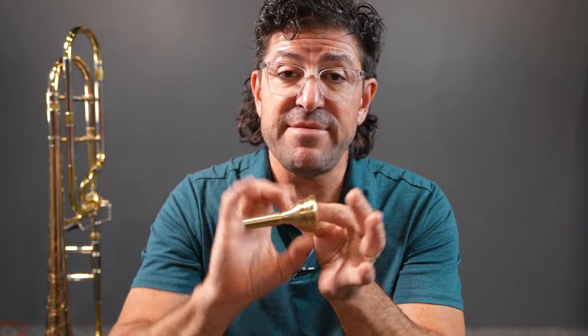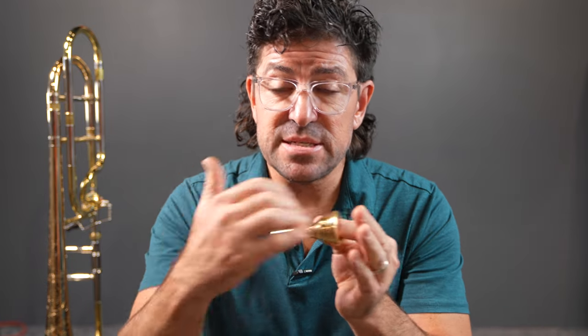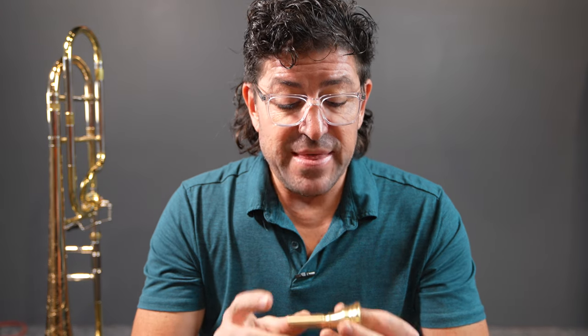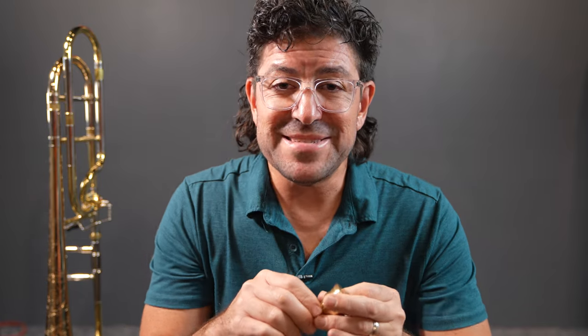Not going to 1 5/8, which I do on some other larger OD mouthpieces, I go to 1 9/16. There's less roughing to get down to this final shape. So these are conscious decisions that I make that will then, we have less scrap, less recycling. It all comes into the equation here. So that's why I chose this shape. Not having the real sharp detail, I can save some time on the machine there.